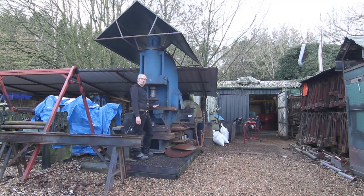This is another one of our presses — it's a big old press. It weighs about eight and a half tonnes and it's about 250 tonnes of push. Most of our work is hot work only. Only rarely do I form any cold steel — it's very dangerous on a press. It generates a lot of pressure, and if the work isn't in the press properly it can fly out and hit you. With hot work it absorbs all the energy. It's a handy machine — we make a lot of stuff on this.